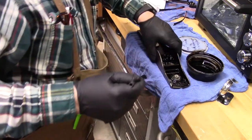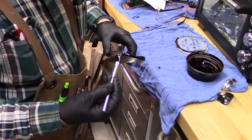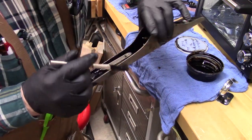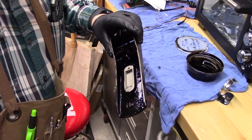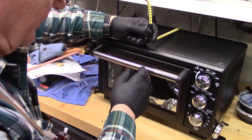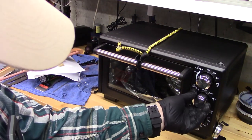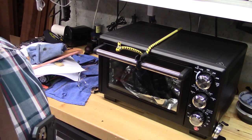The end is japaned — that's authentic — whereas the front is not, nor are the sides, which we're going to tune up in a little bit. Here it is in the oven; it fits in there nicely, it's a little bit of a tight fit so it requires a bungee cord just to hold it nice and snug. We'll fire this up starting at 250°F and run it for an hour.